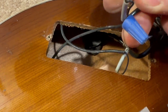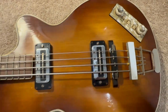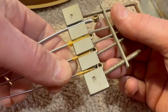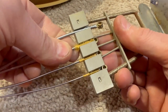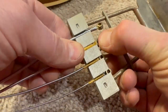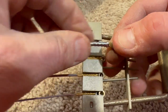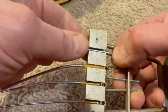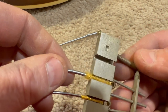An electrician was here — that's the Hofner club bass. Looking at the bottom side of the tailpiece: these two strings fit, a bit tight but they do fit. This one fits kind of okay, but it would be better if it were a little wider. I've removed the silk from the string to try to fit it through, but this part of the string end is still too thick. The only solution is to widen this string slot on the milling machine.